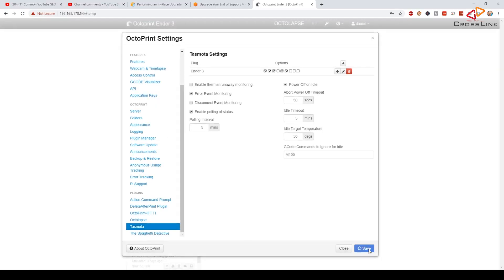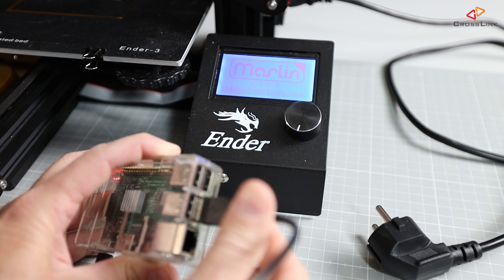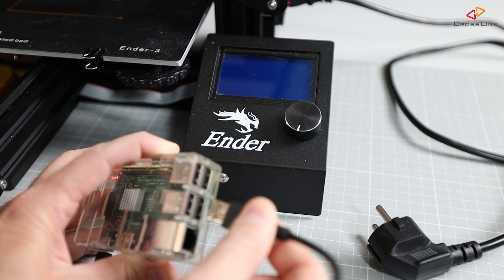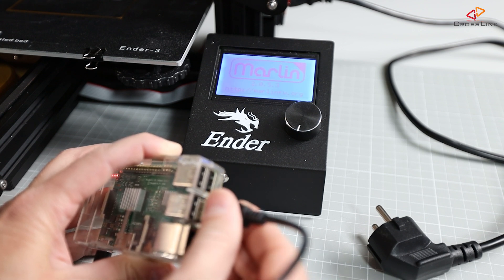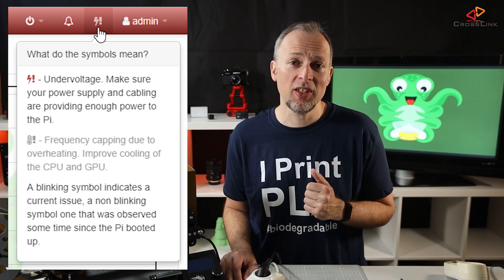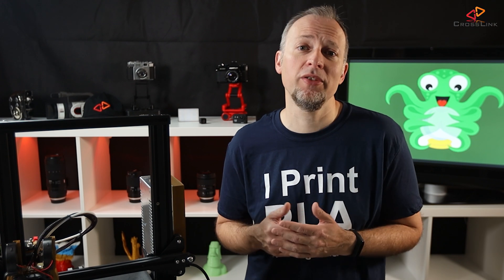There is one little thing left to do. Once you connect your printer to Octoprint while it is shut off, you'll notice the printer's display lights up even though it's disconnected from mains power. This means the printer's mainboard is getting powered over the USB cable from the Raspberry Pi, and that's not good — the Raspberry Pi power supply is not meant to power 3D printers. Octoprint even tells you about this, mentioning it in the upper status bar as an undervoltage issue. This can lead to instability, so we should definitely fix it.